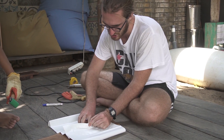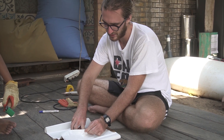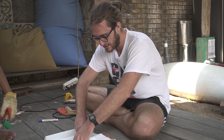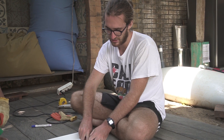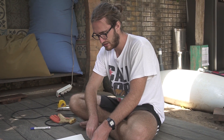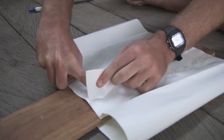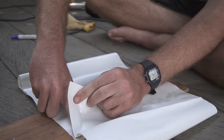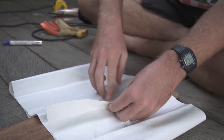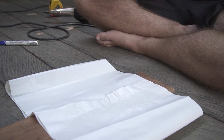Now it is very important to ensure the quality of the weld. Go underneath the material with your index finger and try to push under the weld — as long as you can still push under it, the weld is not strong enough. Go along the whole line. You can hear the sound — if it doesn't move at all, it's good. If you can move underneath it, it's not strong enough. Once you've checked the whole side, fire up the heat gun again.